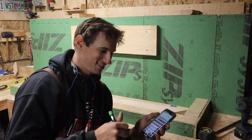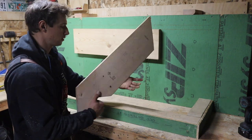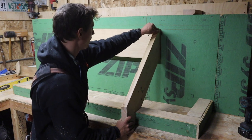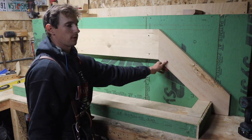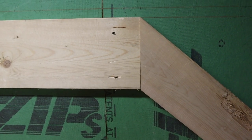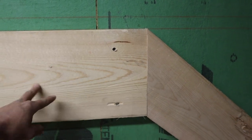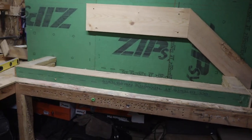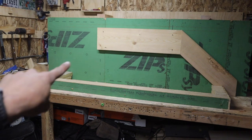Now let's try it. With all of that fixed, that's my rafter — looks real good there, nice and tight. Beautiful. So that's what you want to see — everything nice and tight right to that ridge. See my old mark? And then this is my new mark, and now everything worked out perfectly, right on a 10 pitch. So I'll have that rafter there, that rafter there, the rafters in the middle, and then the hips coming down.